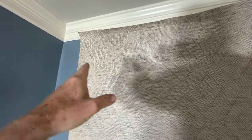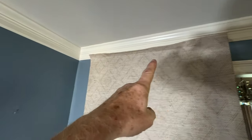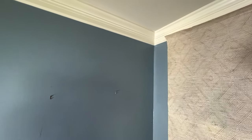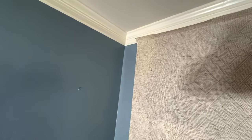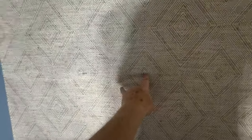So I'm a half an inch down on one sheet, and the next sheet I'm another half an inch. Over the course of 106 inches I'm off an inch — the diamonds are slowly going down. You get the laser level, do a horizontal line after two sheets, and make sure it is perfectly level.